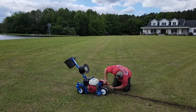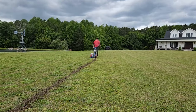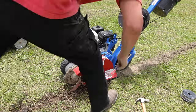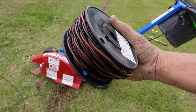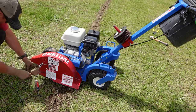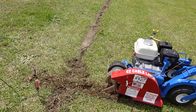This process went pretty good for the most part. The only issue I had were a few wet spots in my yard where the machine got clogged up with mud and I had to dig that mud out before I could keep going. Once you get back around to your starting point just pull out some excess wire and cut it off. Then switch to the twisted wire and run that back to the house where we'll mount our transmitter. Remember — dogs can pass over the twisted wire because the signal cancels itself out, which is why you use twisted wire there.